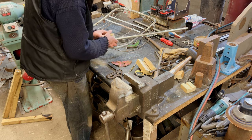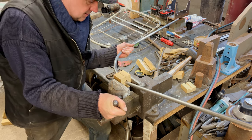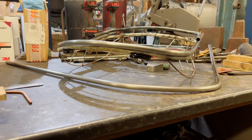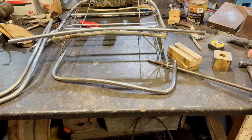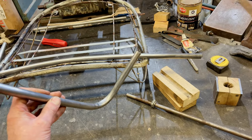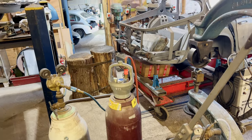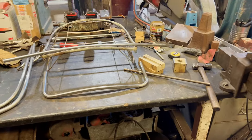Let's see if we can get these in there. I've had to reinforce these though, because they were splitting. Doing it cold is a better way of doing it, but it is quite hard work. And really you'd want a proper mandrel for bending these if you're doing any more — but for what I'm doing, this will work. So I'm using the tree stumps and then using these blocks in the vise, and we're getting nice results. I'm pleased with that.